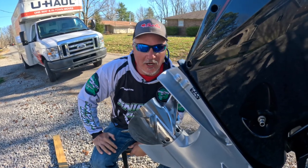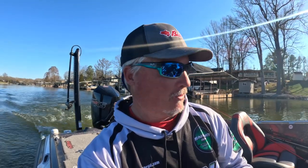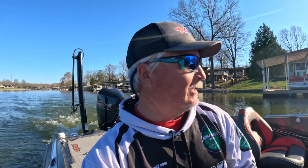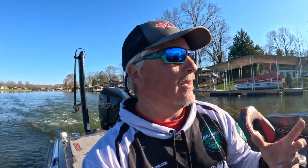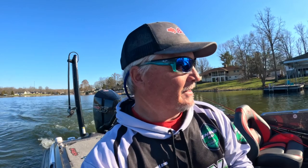And that's how you replace your prop. One thing I did is I reduced my pitch to 24 — I went from a 25 pitch to a 24 pitch. My understanding is that by lowering the pitch my hole shot should be better. Now I'm running a four-blade prop — a Fury — and everybody's gonna have their opinions, but my understanding is a four-blade will have better control in terms of turning. You might lose some top end, but I'm okay with that because I'm not a speed freak. We're going to compare it to the 25 pitch and see how it goes.